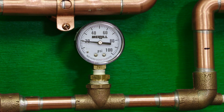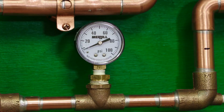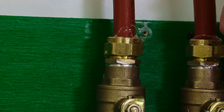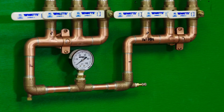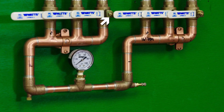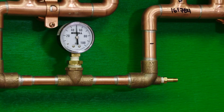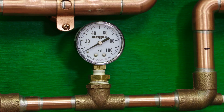If there is a pressure drop, the first place to check is the manifold — invariably one of the fittings is a little loose and will need to be tightened. Get a spray bottle of soap and water and spray the fittings, ball valves, and air stem. If you notice any bubbles, this is your leak. Sometimes the packing nut on the ball valve comes loose during shipping and needs to be re-tightened. Once you pass this initial pressure test, leave it pressurized for 8 to 12 hours. There can be a 3 to 5 PSI drop in pressure due to temperature change; if it's more than that, check the fittings. Note, however, that air leaks where water will not, and if there truly was a leak the pressure would be down to zero.